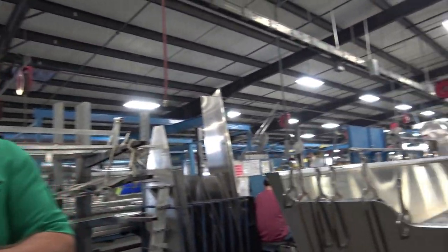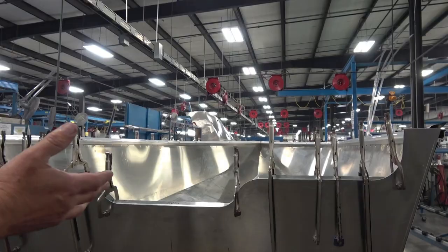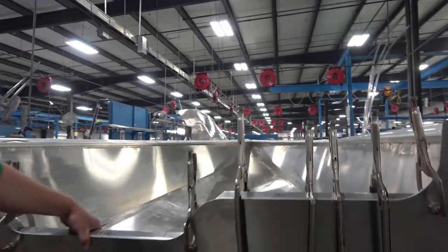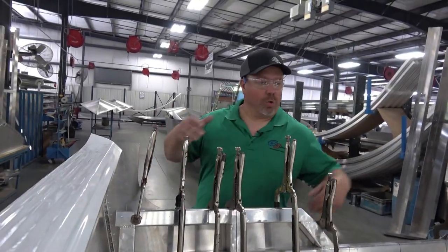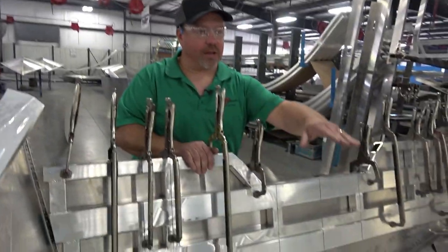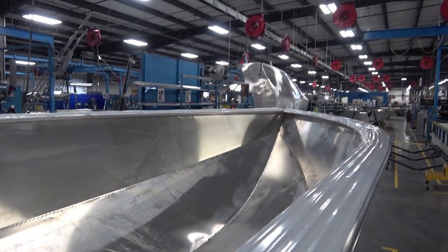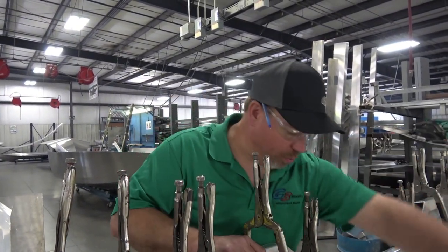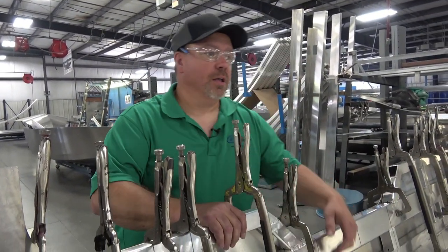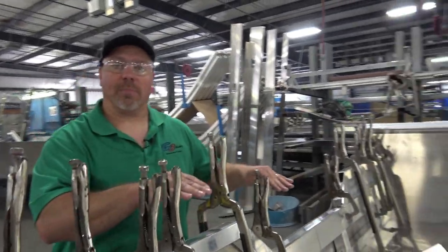After the gunnel's on the boat, we sub-build all our substructure that we can. We put it up on sawhorses and put the transom in — this is a tubing transom; we changed it from wood a few years back. Then our substructures will go inside, we'll drill them down and suck out all the gaps. In the bow area of this boat it'll be double-plated. On our 17s through 21s, they're double-plated all the way back to the transom from the bow, and the substructure goes on top of that.